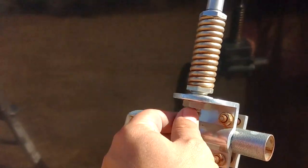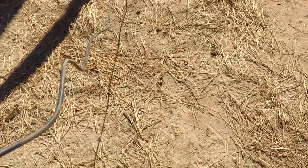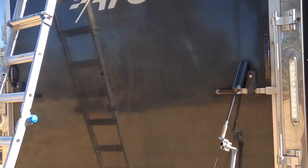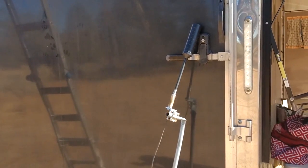There's the antenna. I've been looking at the coax cable and it doesn't look bad — it's not chewed up, I don't see any holes or wear, and it's not crimped. So the problem is not the coax cable. It's definitely the WeBoost unit itself — it just ain't boosting like it used to. I pretty much got everything off of there. I just thought I'd shoot a little video and tell you about our 4G options and solutions. This has been Road Pickle Steve. We'll catch you later. Over and out.